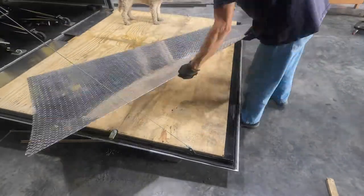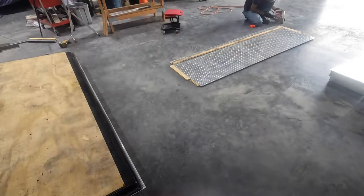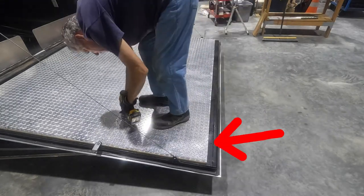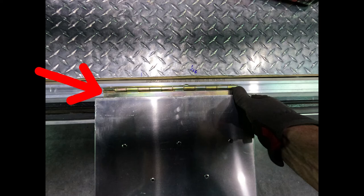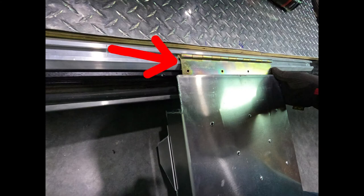Putting the plywood back on — notice the two and a half inch strip is already cut off of the tail end. Now we're going to get set up to cut off that two and a half inches from the piece of diamond plate. As we're getting this last piece of aluminum on the door, I wanted to point out that I've drilled and tapped these holes to three-eighths by 16 for the track bolts. Now that we're getting the tracks all fastened down, we're going to mock up the ramps to find out how far back they're going to need to be to make them where they don't hit our door. You can see they're back far enough that they're just about off the hinge, so we're going to need a four inch wide by 13 and a half inch connector filler plate to put in here to make this work.